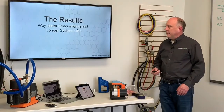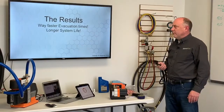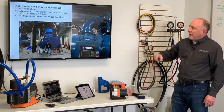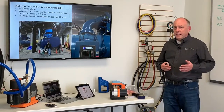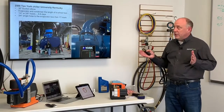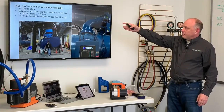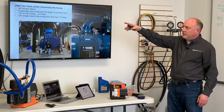So now I want to get in here and talk a little bit about the results, way faster evacuation times and longer system life. This is a 2,500 ton York chiller at the University of Kentucky. There's a video that Andrew Greaves and I did on this. This thing is about the size of 2 buses. I mean, it's a huge, huge chiller here. About a 30-inch suction elbow. Evaporator and condenser lengths are, like I said, about the length of a school bus.